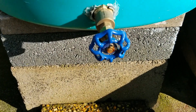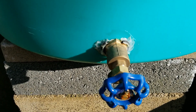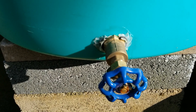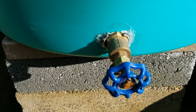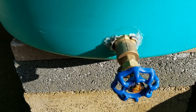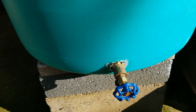On the bottom I've got a three-quarter inch valve. The way I put mine in, I put it in with silicone. I drilled it just a little bit smaller than the three-quarter pipe threads itself, then force-screwed it in there. When I got close to running out of threads, I put silicone sealant on it so it's sealed tight — it's not leaking. That's working pretty good.